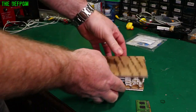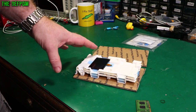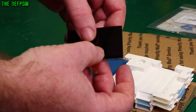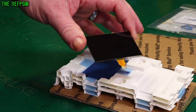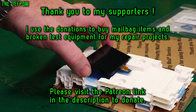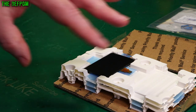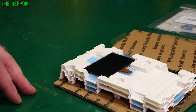So these are some LCD displays — Sharp Memory displays. I've used these in projects and they work really well. I've done some Phantek timer stuff, like a timer interface I use for events, and that has an OLED display on it. I want to replace it with some of these LCD displays instead. I've already used these displays on other parts of the system because it's used outside, and these are really easy to see outside. They look really good because the lighting reflects off them — they're reflective displays with a really high resolution. The OLED displays don't look anywhere near as good and they're much harder to see during daylight, so I actually want to replace them with these.